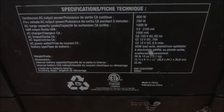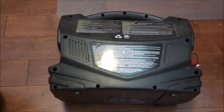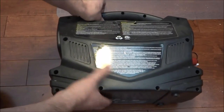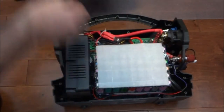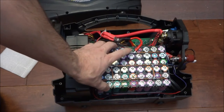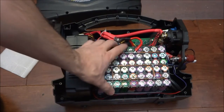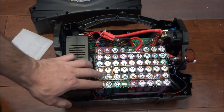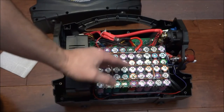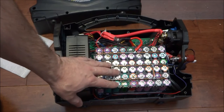I'm going to open up the pack and show you what's inside. Inside you can see the lithium-ion batteries — there are two groups of 54 cells, one on top and one underneath, stacked on top of each other. This makes it 18 cells in parallel with three in series, three banks in series, but they're interconnected so it ends up being a 36-cell pack, three in series.